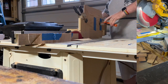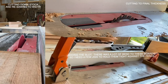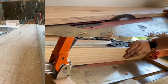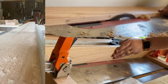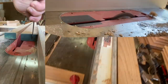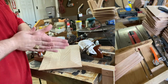That jig just slides over the top of my fence — it's got a little bit of play and wobbles side to side, but I held it in the same place every time and it seemed to work okay. Then different views here of getting the rails and stiles cut to size, and getting a slot cut down the sides. Some of these will stay very long and be the stiles, and others will be cut short to be the rails going across between the panels. I'm using a stacked dado cutter to cut that groove, sized right for the edges of these panels.